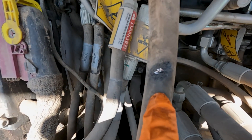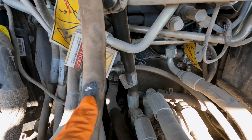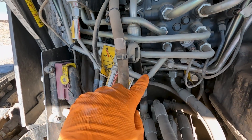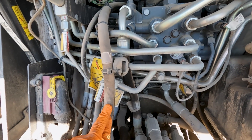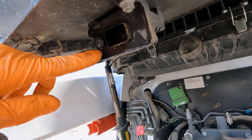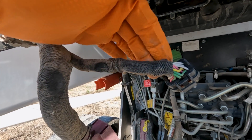This is going to be our charge hose. See right here where it's rubbed through? That's the metal braiding on the inside of the hydraulic hose. So we're going to need to repair this hose. But to get them up and going today, what we're going to do is just kind of reroute this hose. We're going to loosen the fitting, spin it a little more, and adjust where this is wire tied here with this rubber boot. This rubber boot just keeps the noise down where that was vibrating on the metal tube. So we just need to adjust all that to keep the wiring harness from rubbing right there. So what we have here is our cab controller, and that's where the signal for that door sensor is coming from.